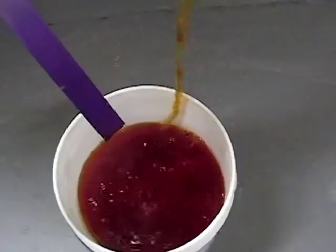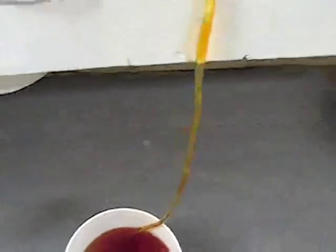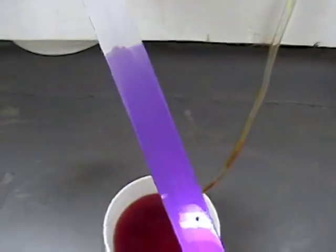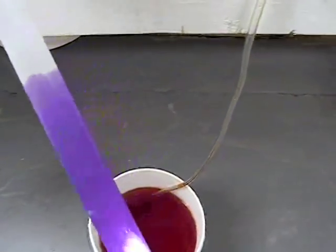In this example, note how quickly the dye takes. We used a large pipe with dye at full concentration and achieved a very slight fade. To lengthen the fade, you may need to weaken the dye and speed up the dye flow.